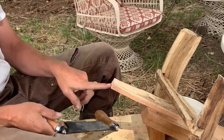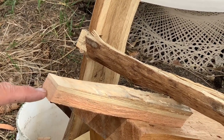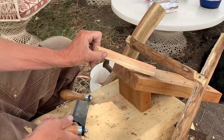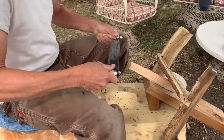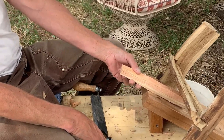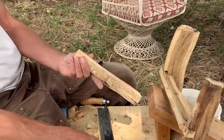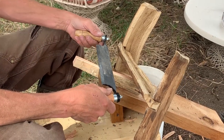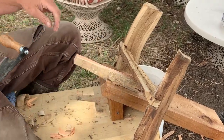If we look at the end here, you can see I have a good flat plane — we like that. I'll clean up this side so I've got a good flat edge that's parallel to that. I will release the jaws with my feet, turn the stock, put it back in, and then I want to get this to three-quarters of an inch. I'll check that against my marks here — sure enough, three-quarters of an inch. Now we'll do the sides and get them to that same tolerance, trying to be square to the two parallel cuts I just made.